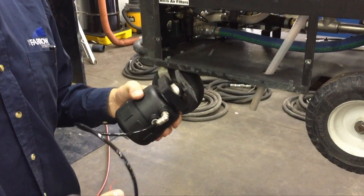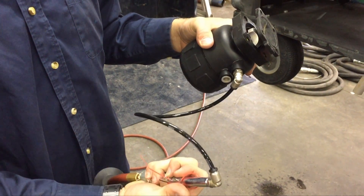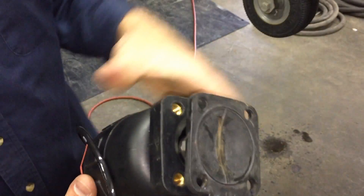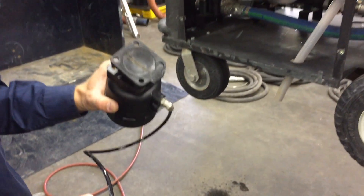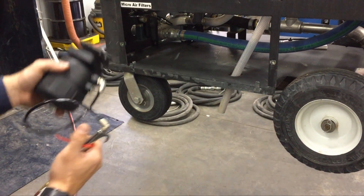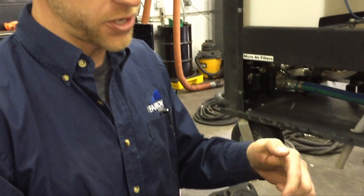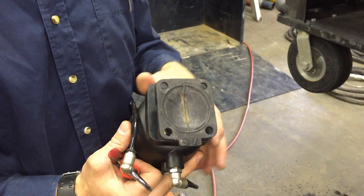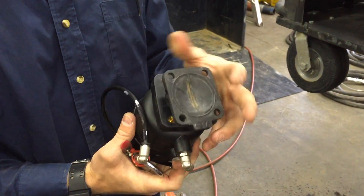I want to quickly show what's happening when you retract the spring so you can get your bolts back in. With shop air on, you can see it retracting — very important, otherwise you will struggle all day. Get this back into the machine, line it up properly with the cast iron piping, and tighten all four bolts. When tightening back on, use a cross pattern — just like a four-lug tire. Tighten completely on all four, then come a half turn back on each one.